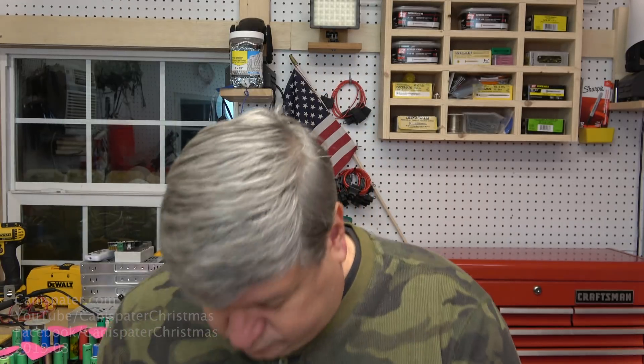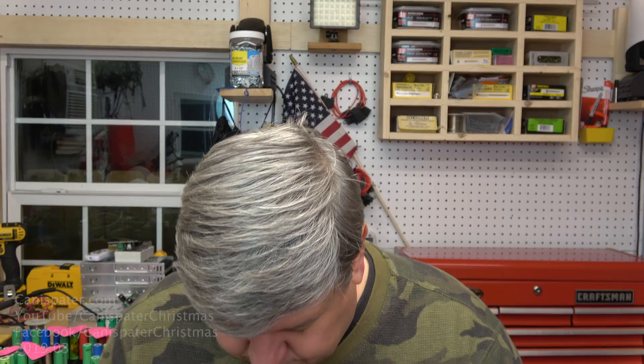For the load, I got five of these heat lamps, so it should be 1,250 watts. They did a pretty good job — they're used for keeping food warm and things like that. It's just an infrared light. You put them in the bathroom to heat it up, that kind of thing. I decided to get a number of those because they would roughly equal what a space heater would be, which is also probably the upper range of load for this generator.